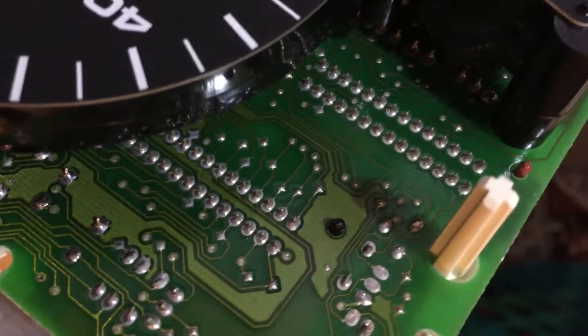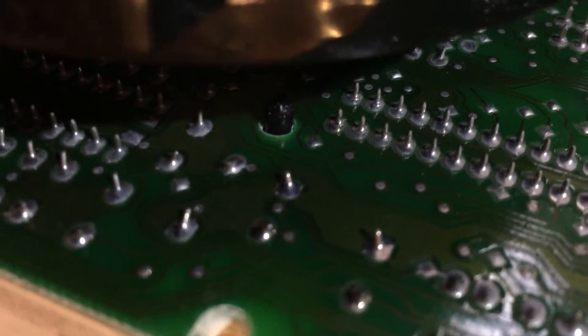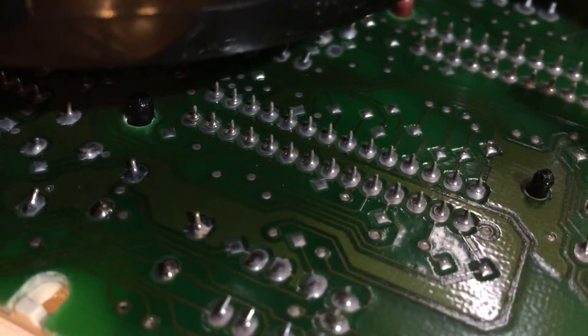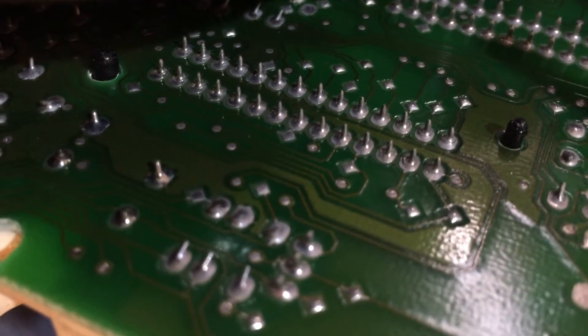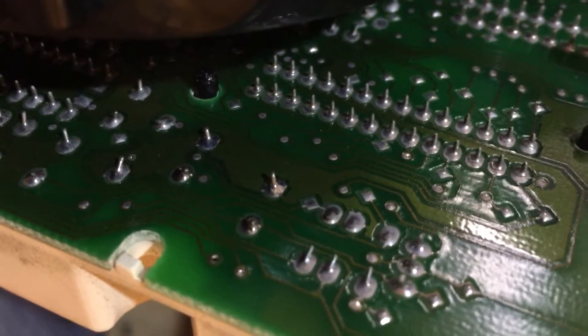Let's take a look here — I'm going to grab the phone and show you. These are the black and red connectors right there, where they fasten to the board. These series of soldering points are very weak. If you look real closely, you can actually see there are almost little rings around there, or it's kind of flat. You can see that second from the end — that's where the soldering broke. So what we're going to do is simply go ahead and re-solder that.